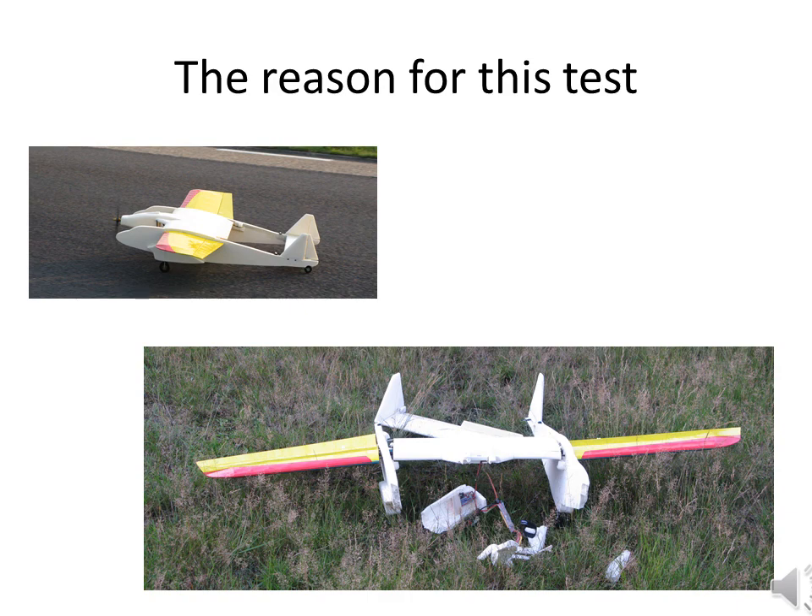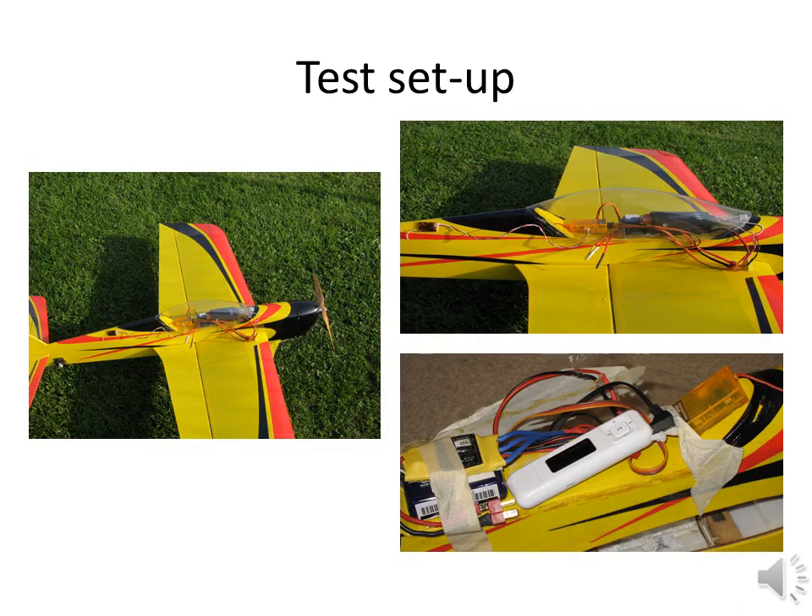Apparently just doing a range test is not sufficient. This was the test setup for this test. I installed the complete second system as a piggyback in the cockpit of a small aerobatic plane. The receiver signal as well as the voltage of the receiver power supply are continuously monitored by a data logger. Originally I used the PowerLog 6S data logger for the measuring. During later tests I used the Transcend Sonic 330 MP3 player with the line in as a data logger. Both methods proved to supply reliable data about the transmission quality.